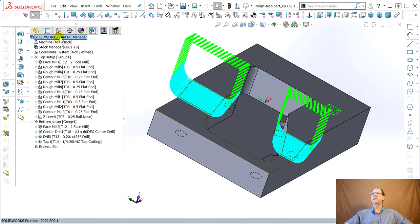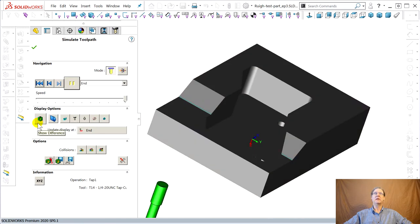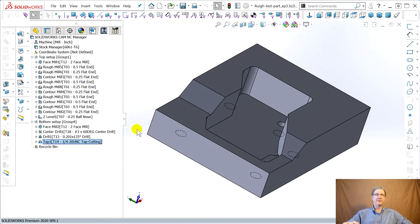And if we simulate the tool path, go to the end, that blue's much smaller, almost indistinguishable. It's not perfect. You can get a pencil mill maybe and go in and make it even tighter, like an eighth inch or a 16th inch, if it's important to have a sharp corner. But that was operator error on my part. Okay, so we fixed that.